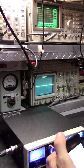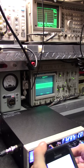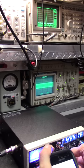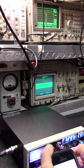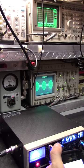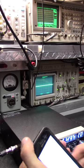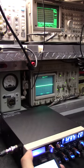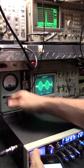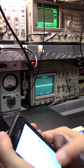But for this radio, for instance, that carrier is like 3 watts, and almost 4 wide open. Almost. Yeah, 4 watts. Straight up's like 3. And a 3 watt carrier is doing like what? 13.5? Alright, call it 14. Now let's look at the continuous power. Almost 5. Like really close. You're splitting hairs. 5 watts. So call it 14.